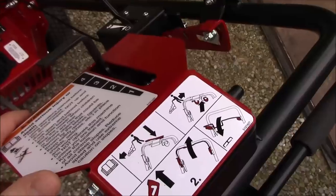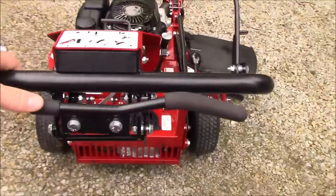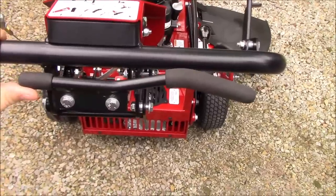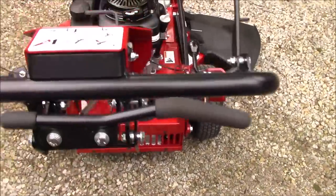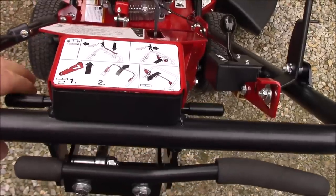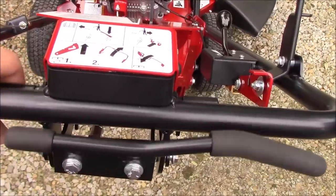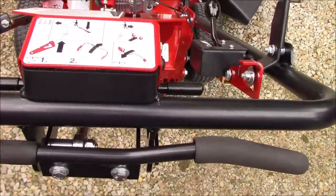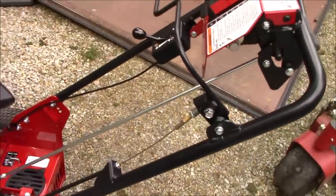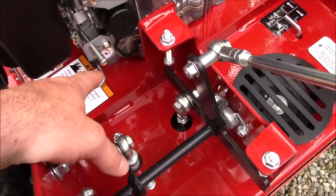On the speed setting, it goes one through four — one being the slowest, four being the fastest — giving you a ground speed to walk or mow at. Operation is really simple: pushing down here is your forward speed, and pushing up is reverse. It also has little pegs on both sides that you can use for reverse — just pull those back. So down is forward and up or back is reverse. Pretty simple — guys handle these for the first time and they're super easy to use.